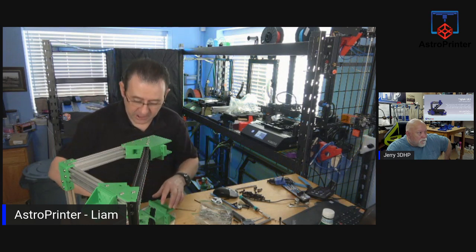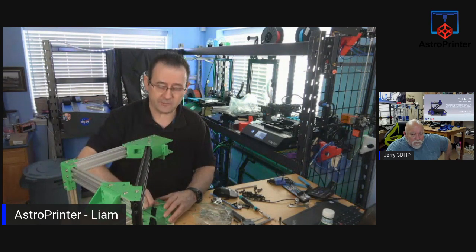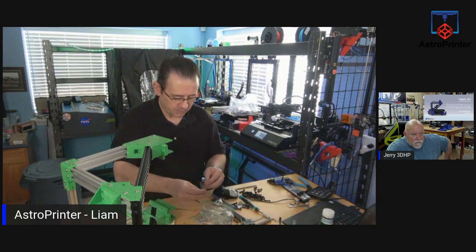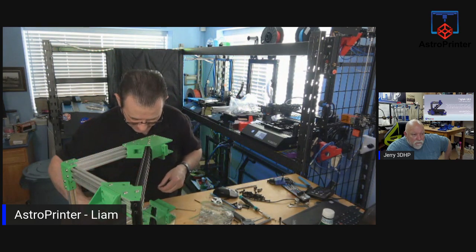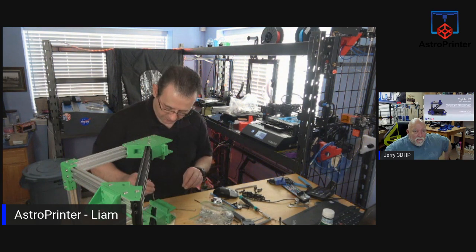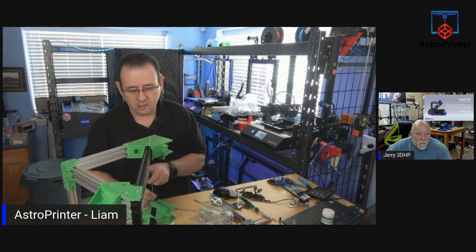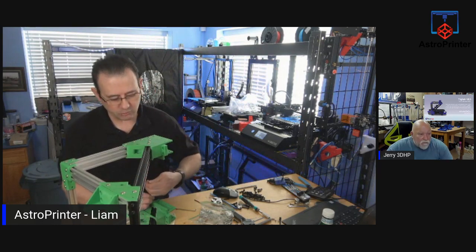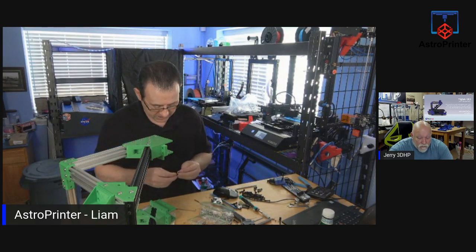And if you don't have these and they're needed, you'll have to get them. For sure, if you don't have a fuse kit, you will need one, because the Ender 3s, and I haven't even looked at the electronics on this one, but historically, the Ender 3 does not have fuses. You will need a fuse kit to make it really safe. So you should invest in one if you're going to go with Ender 3s. Because if you're going to rebuild a new printer, why not do it right instead of doing it one way and then changing it later on? Okay, just do it right the first time. And we'll be doing that on stream if it's needed. We'll be doing those when we get to electronics.